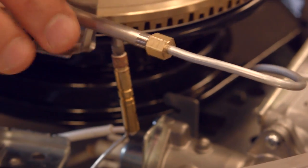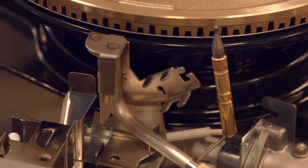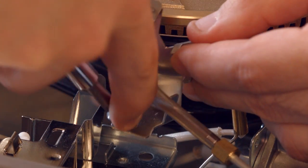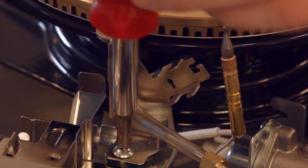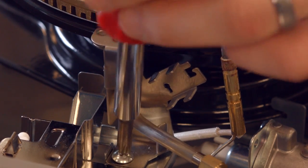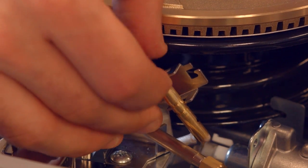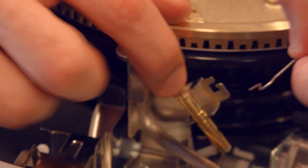From there, we can go ahead and place this back down onto our housing for our pilot assembly. An easy way to get this screw back in is just go ahead and put the screw on the housing itself and aim with that. And that's how you replace your pilot orifice. And then be sure that we put our thermocouple back into its place. And the clip, be sure when you're using your clip, the hoop is for your finger to hold to push it back in place. The single-sided end is for you to actually brace the thermocouple in.